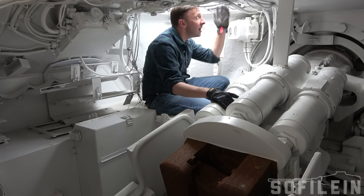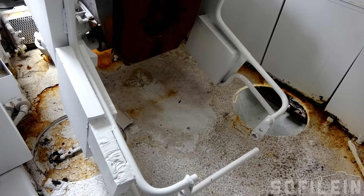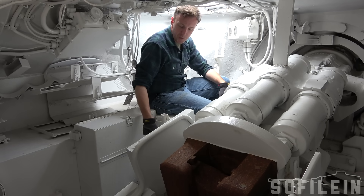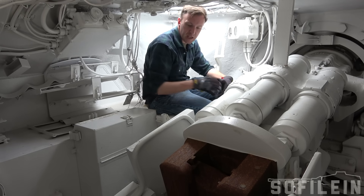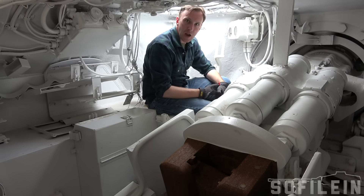In the case of a fire, if I'm here at the hatch, I'm very lucky because I can just go right out the hatch. Also at the bottom of the vehicle, there are two escape hatches — one on either side — with the simple movement of a latch. They're pretty heavy and will fall out on their own. However, if you are in very soft ground where the tank has sunk in a little bit because the tracks have dug in, you're going to be disappointed when you drop those because they may only fall two or three inches. That actually was a complaint because a very similar hatch design on the T26 E3 Pershings that went over initially saw crews try to escape and find the hatch only fall two or three inches in muddy ground, which caused them real issues.